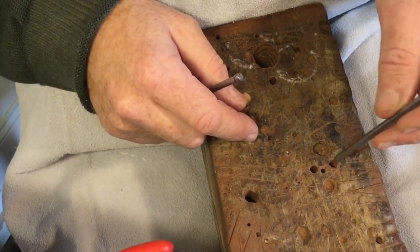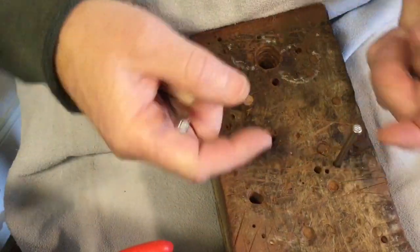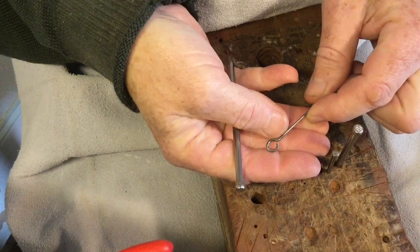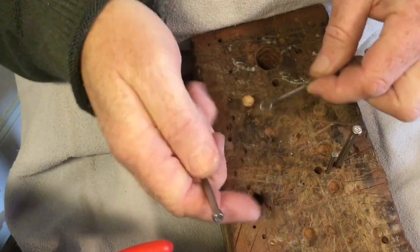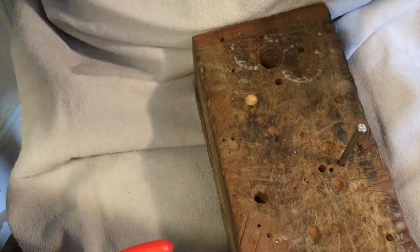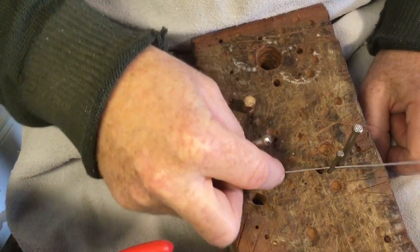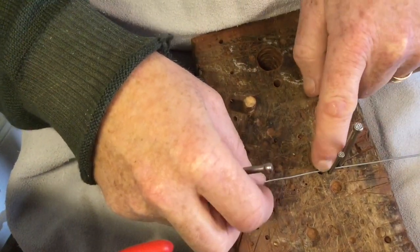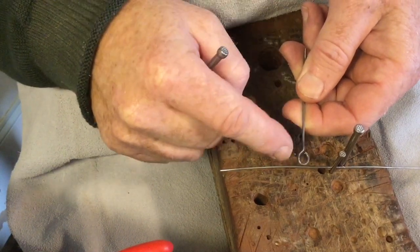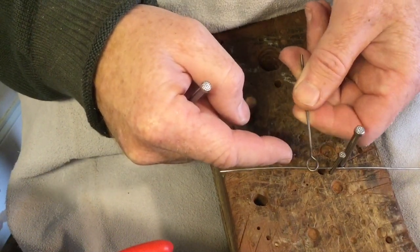For doing the handle we need a stop pin so that when we bend the wire back the other way, it won't just swing around. This lighter pin is for the base — the elbow at the base of the eye — and then another pin to wrap around and create the eye itself. The wire goes in between them and we swing, with the stop pin preventing travel. This is just tie wire so it's much softer. With music wire I had to hit it with a blowtorch to bring the temper down — anneal it — so it was actually a more bendable substance.